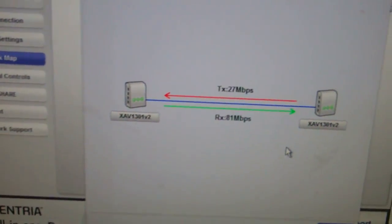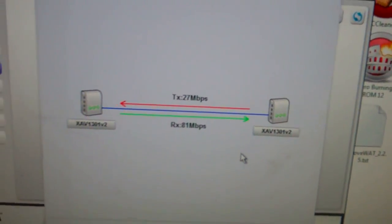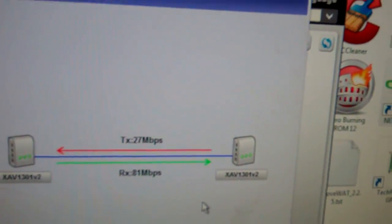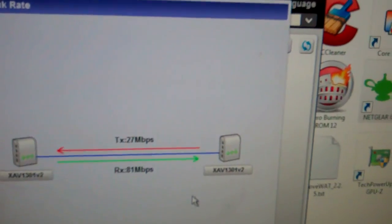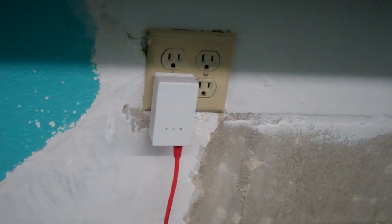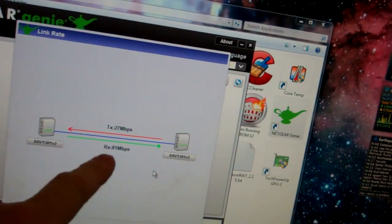Success — let's call it a qualified success. My capacitor solution was a waste of a few dollars — 41 cents per capacitor but $3 on shipping. But the bedroom is now receiving at 81 megabits and transmitting at 27 megabits, about double what it had before. Looking at the adapter, we see green — well, now it's yellow, not red. It was green just a minute ago. All it took was changing the phases the bedroom was plugged into, swapping the breakers around to the alternate phase, and everything is good. I guess when you average red and green together, it turns out to be yellow.